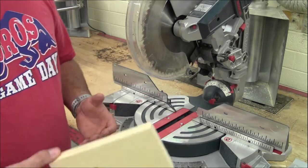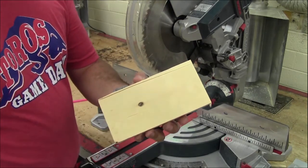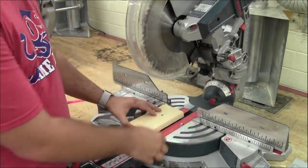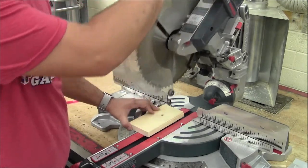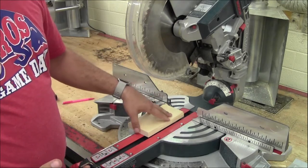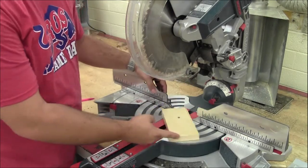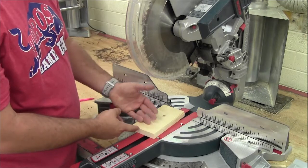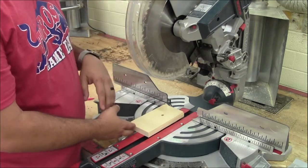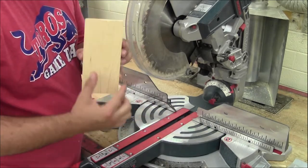One thing you should know not to do: let's say I need to change the depth of a board to only three or three-and-a-half inches. I'm not going to put this on the miter saw and try to cut it this way — this is not the right tool to use for that. We have a table saw and other tools that can make those cuts. Because the piece is small with no support on the back, it can easily rotate, which can be dangerous — the piece can get caught and thrown or jam up the machine. So again, you should not be changing the depth of a piece of wood on a miter saw.